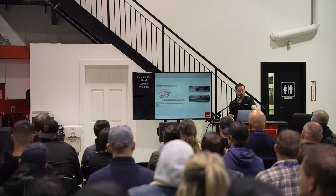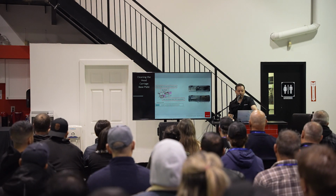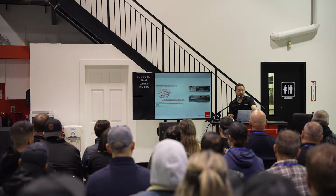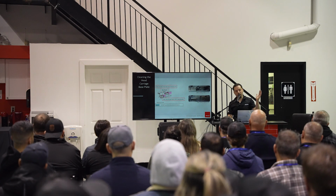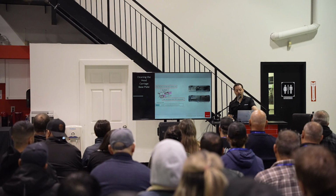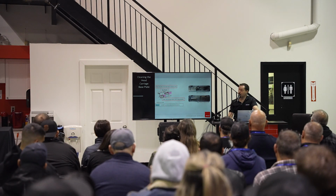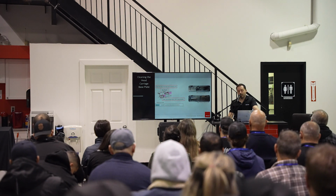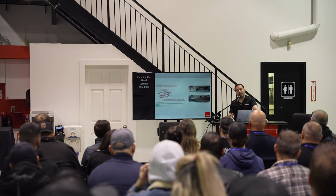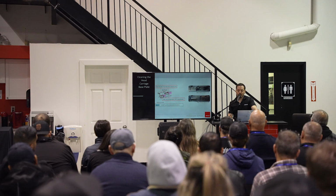Another thing you'd want to do is clean around the print heads. We say cleaning the print heads and the caps is very important. There are sponges on the machine, so when the wiper is wiping the print head, it's pushing ink over, which can get ink back onto the bottom of the carriage in these spots that are highlighted here. You can see what it looks like beside. If you were to leave that, those sponges would get soaked up and not be able to absorb ink anymore, and what it would be doing is just painting on your print head every time it comes over. So you want to make sure to clean those areas.